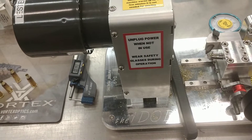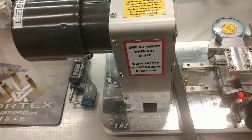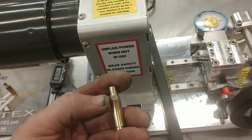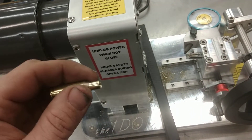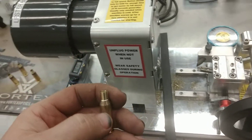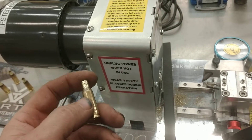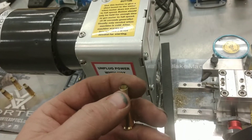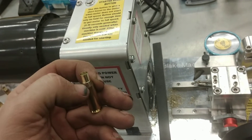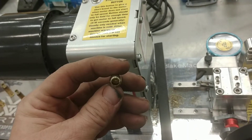Like I said, the very best way I would recommend is to get a 220 Russian die, expand it, and then run it in a 220 Russian full-length die. You will physically straighten out that body to the neck prior to turning and you won't have any neck concentricity runout. When you expand brass - and it doesn't matter which way you're turning, if you're turning on a mandrel it's the same thing - you'll see cuts and shoulders of people who claim they're getting good cuts on neck thickness, but it'll be cut way heavy on one side.